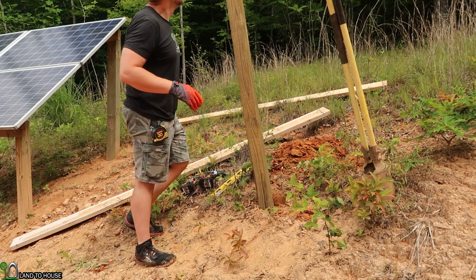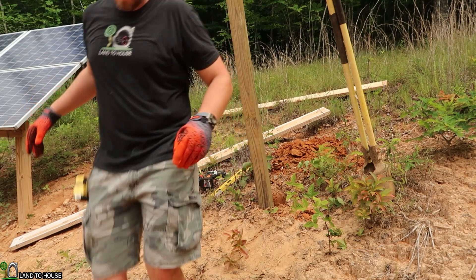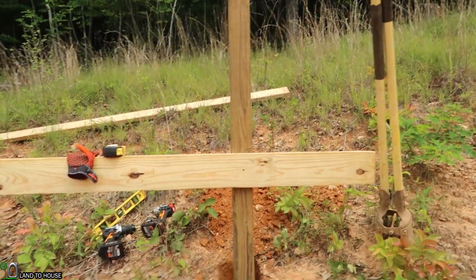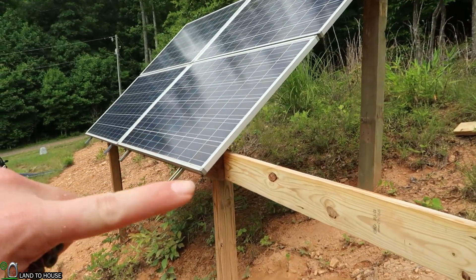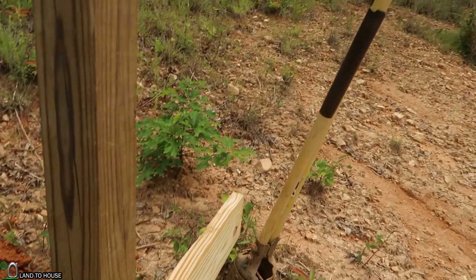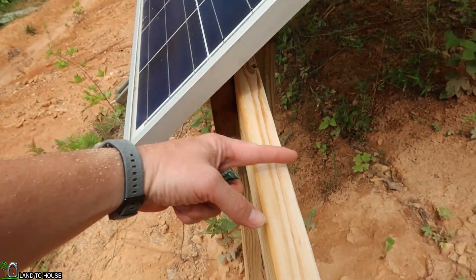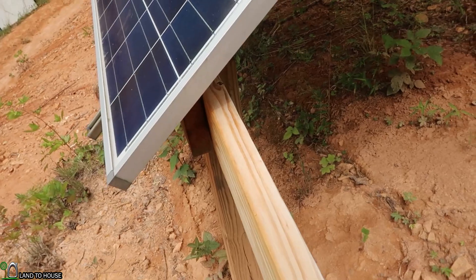It's starting to rain — I'm not sure where it's coming from. It's not good for cameras though. The strangest little rain storm just passed by. So I sank the post in the ground, leveled things off, put a single screw in to kind of hold it up. But then I started measuring, and because I'm letting my panels in this direction, the first one comes out to here and the next would be past the end. I've cut a couple of boards to extend this little gap so the new board will come out far enough and hopefully won't sag down.